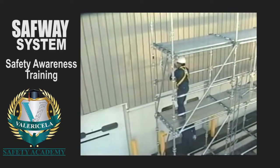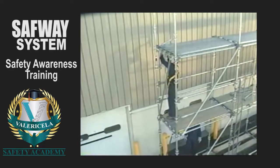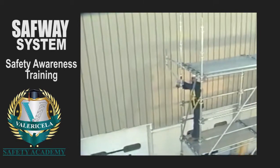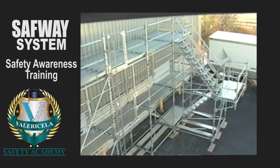If the scaffold can't be erected within reach of the work surface, side brackets are available to widen the work surface. When side brackets are used, engineered scaffold ties, standoffs, or guy wires may be required to stabilize the scaffold at the first platform level to prevent it from tipping over. The erection procedures are repeated for the next level. Stair towers are erected using SafwaySystem scaffold components.